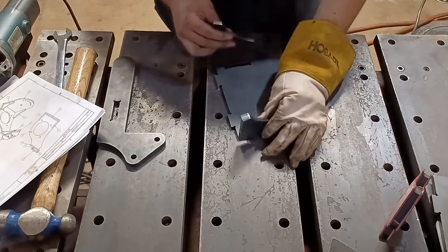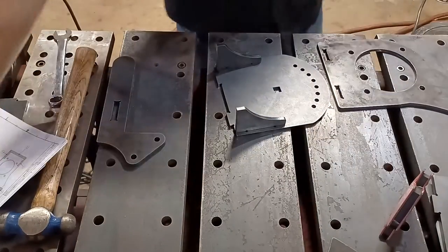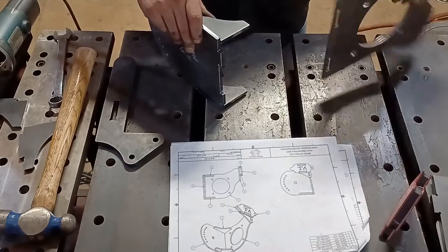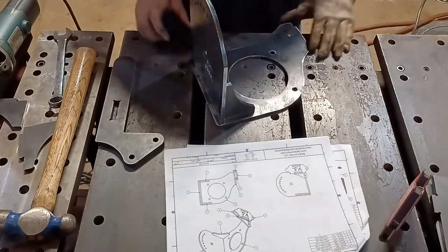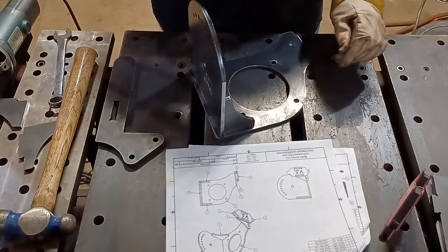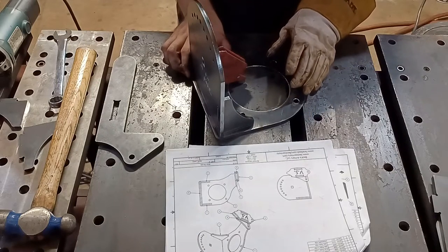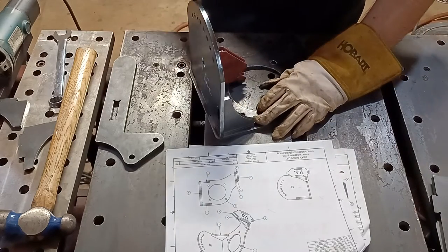You have three of these same-sized gussets and they attach to this part. Look at the 3D picture, set it up just like in the picture. First thing — we just need to tack everything in place and make sure it's square. I'll grab a magnet here. I always tack the gussets first, because if I tack a gusset it's not going to pull the whole thing crooked. Tack the gusset first, then tack the joint down inside. The inside of a 90-degree joint always has the most leverage when welding.